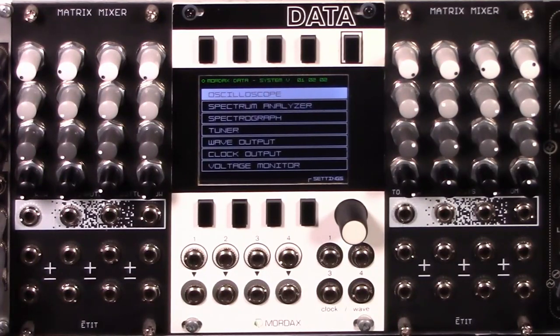Both modules have jumpers on the back for each channel independently to provide DC coupling, or removal of said jumpers to give AC coupling. At first glance, you might think of this as not exactly complex. Sure, it can mix audio and send signals to parallel sources in varying degrees, and if you've played with a modulation matrix on any other synthesizer before, then you know it can be quite powerful, and this is in the modular realm, where practically any signal can route to any destination.